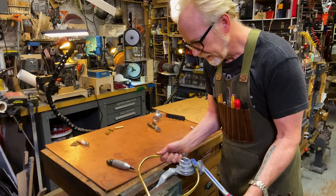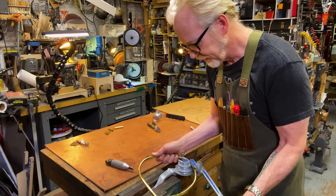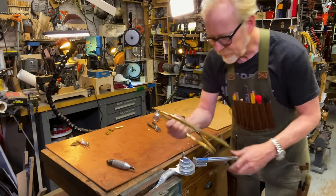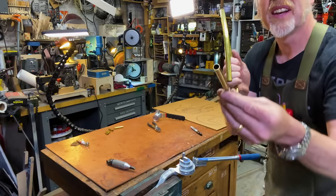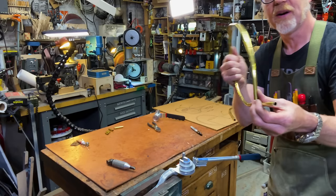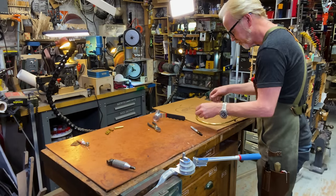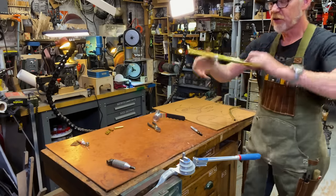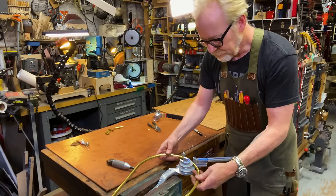And there's this way in which you can get into this move, bend, move, bend, move, bend. And it's almost like a physical dance. And then you look up and you're like, ooh, that's really nice. And by the way, this is a nice marker that I'm staying on a very specific plane. I'm only about half the width of the brass off at this point. That's great. That tells me I'm on the right track. Also, having two nested tubes is helping me maintain, not buckle the brass.